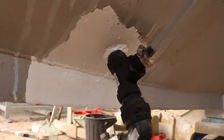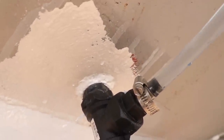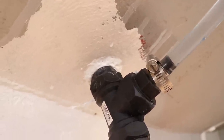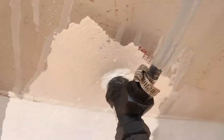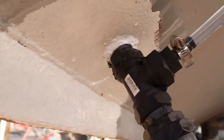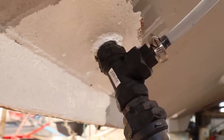And then finally right down the very bottom here, where we've got our irrigation fittings. That's a bung that we welded in. I can't see any, well sorry, that was a nipple that we welded in to put a bung in there, and I can't see any dripping or leaks or anything like that coming out the back end of it there. The original one was mild steel and it was just absolutely toast from rust. So this was a stainless one that we put in. Okay, so that tank's done now.